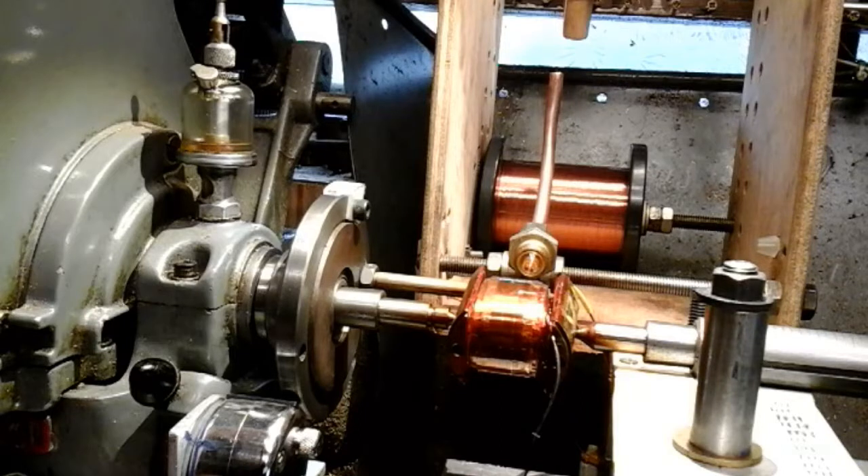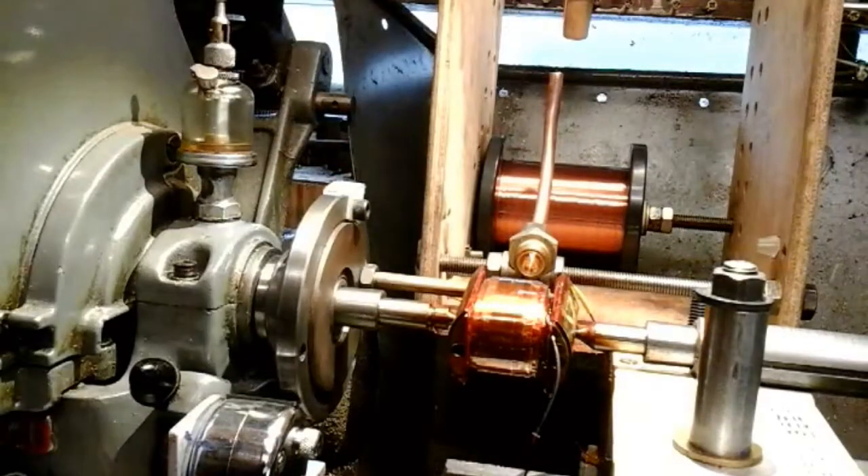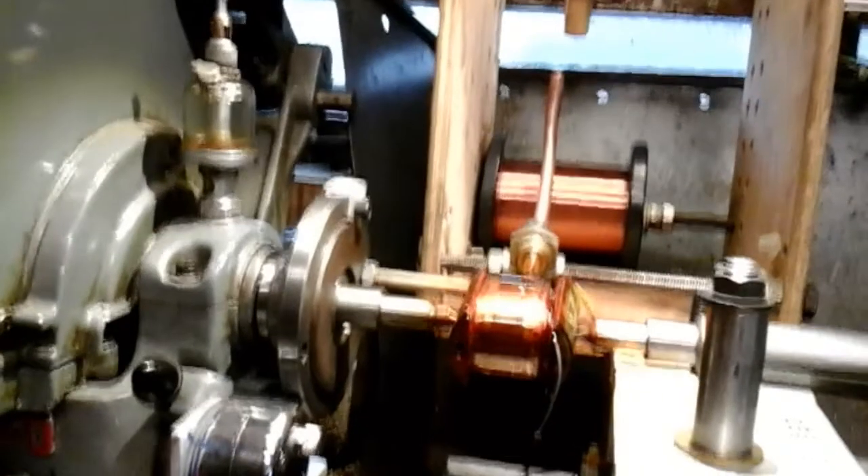By the way, I've finished the secondary winding now. I've put nearly 11,000 coils of wire on, and about 62 layers of wire and insulation. So that's where I'm up to at the moment - I'm just ready for cutting it off and removing it from the lathe. I just thought I'd give you these few tips.